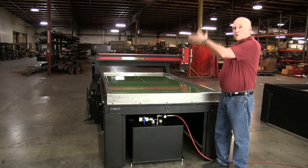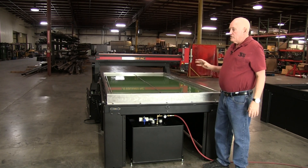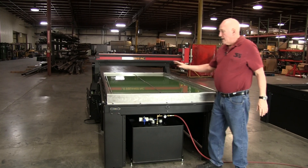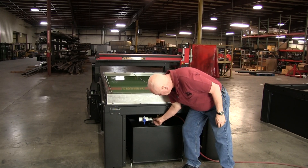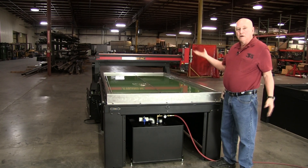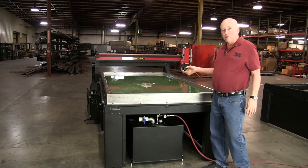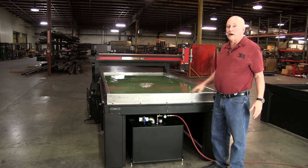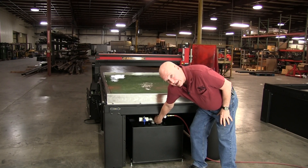They've literally had plates explode off the machine vertically because the hydrogen lit up underneath it. So with this system, I can cut aluminum — then I turn right around, open up my valves, my water's on the way back up, and I'm ready to cut steel. By the way, if OSHA walks through your door while you're cutting aluminum on a water table and the water level is high, just watch out — they know about that little hazard.